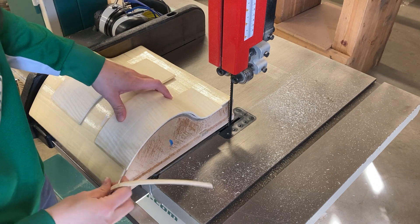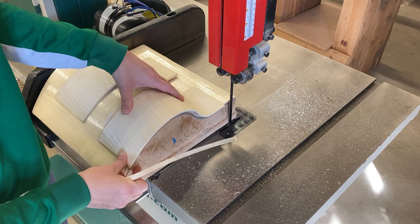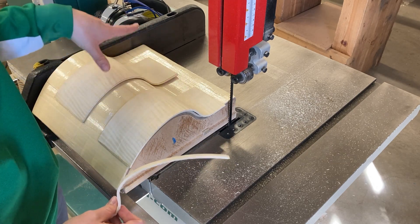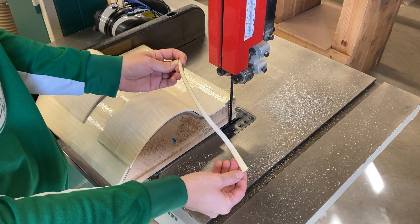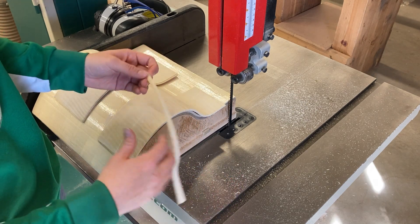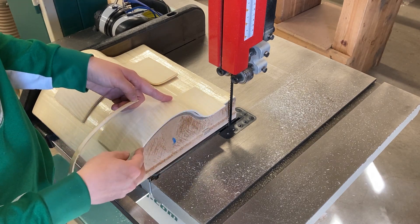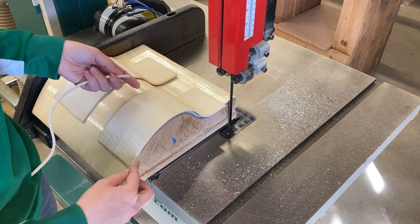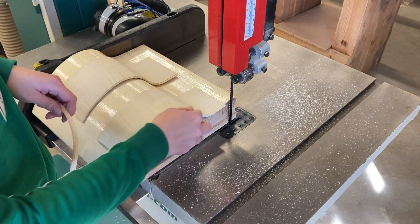As you could see, I've made an off-cut on my mold. The double-stick tape held my lamination securely in place, so all I had to concentrate on was pushing my mold into the fence the entire time. The piece wasn't actually as crooked as I thought — it was probably more like a quarter inch off parallel. But now I know for sure I have a straight, square edge that is perpendicular to the surface of my curve. All I have to do now is flip my hand plane upside down in a vise and smooth out this edge.